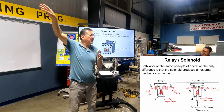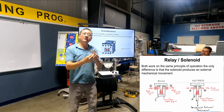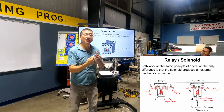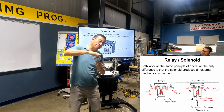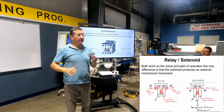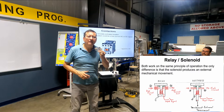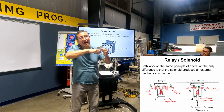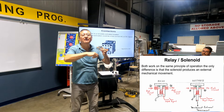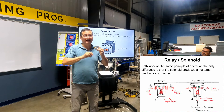Any switch? Any remote switch? In the flybridge, in the helm. The signal enters here and produces a magnet and closes the gap — and the current flows to the other side. This is a relay. The solenoid is the same, but the piece of metal that closes goes out and produces mechanical movement. The solenoid is pretty similar to the relay, only that the solenoid has external movement.